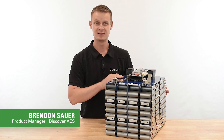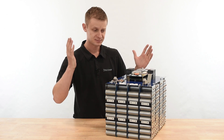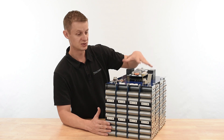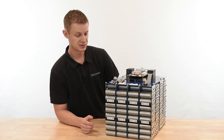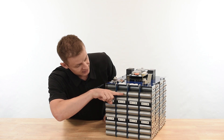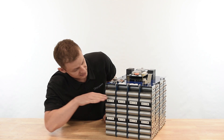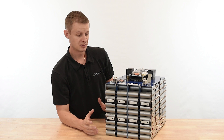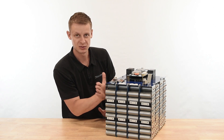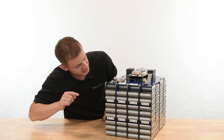The 42486650 is Discover Batteries' largest 48-volt lithium battery. I've gone ahead and popped it out of the case — what's left is the cell block with the electronics package on top. Focusing on the cell block, you can see that the cells are actually attached in series as well as parallel, so the current flow is going directly through the cell. Alternatively, it's quite common to have just the modules paralleled with a nickel sheet, where that current flow wraps around the cell modules.